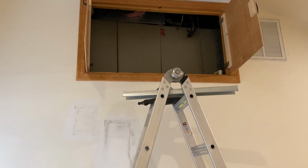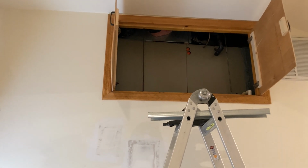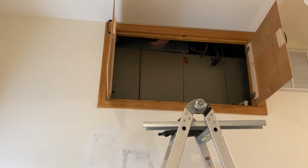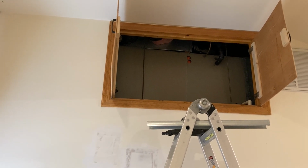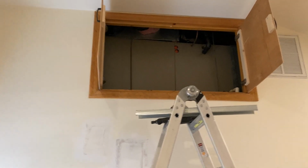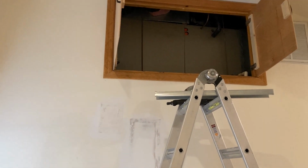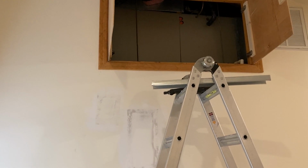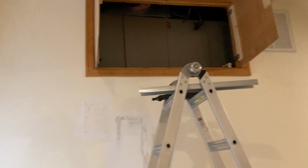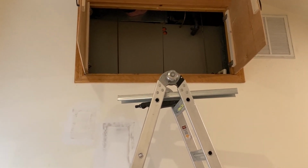And the issue that I'm having, or that I was having, is that I was getting a lot of water, condensation coming out from the emergency secondary drain. So I went up and looked, wondering what was going on, and noticing that the pan was filling anytime I would run the AC. And it turns out it was because the unit was leveled the wrong way.